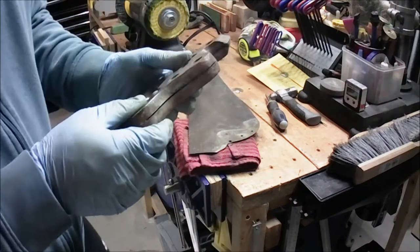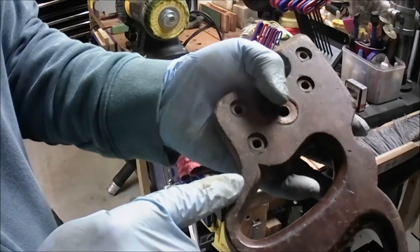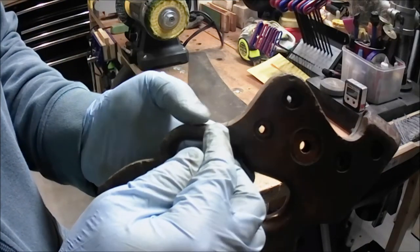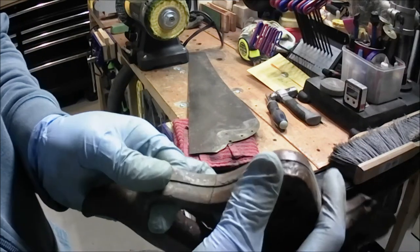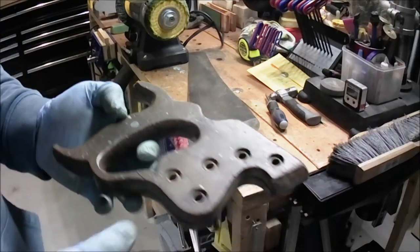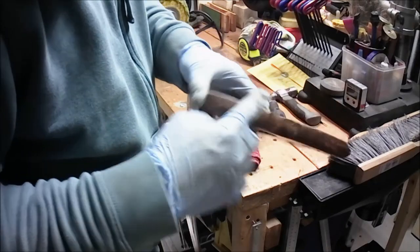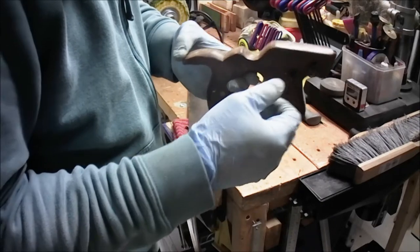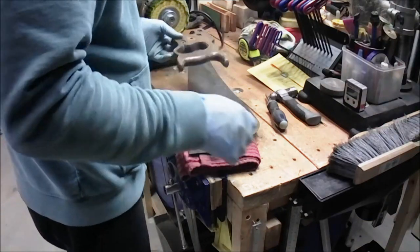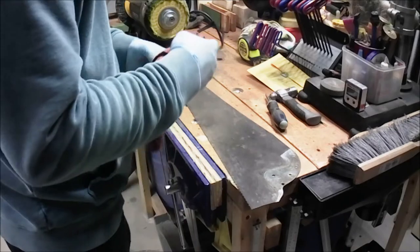On closer inspection, you can see this has a small little crack right here. What I intend to do is use some glue syringes — I'm gonna inject some glue in here and then clamp them back together. It's a minor crack, but eventually it will crack through and this piece will fall off, which would be a really bad thing. The rest of it is in pretty good shape — a lot of missing lacquer, but understandable for the age. The blade itself is in pretty good shape.